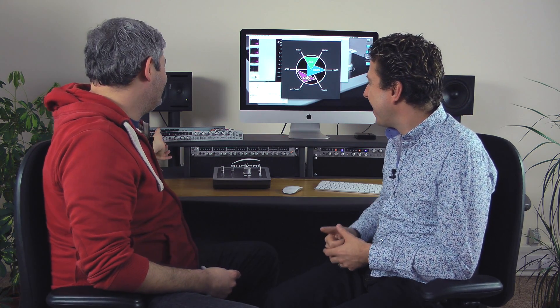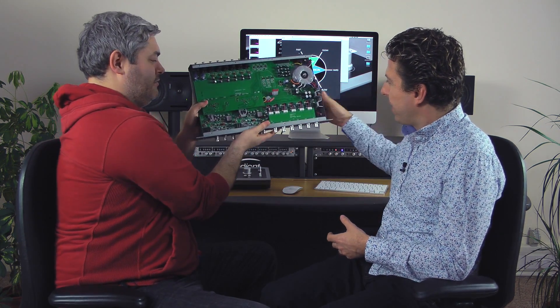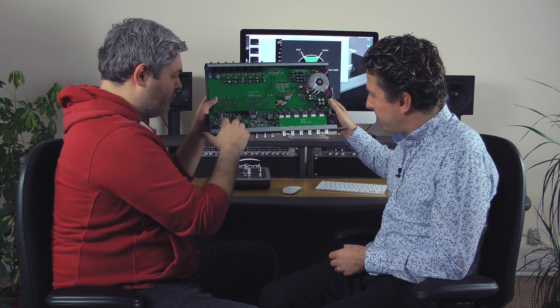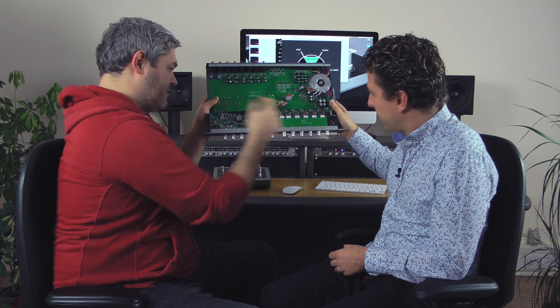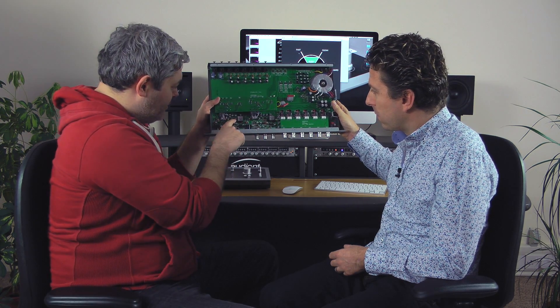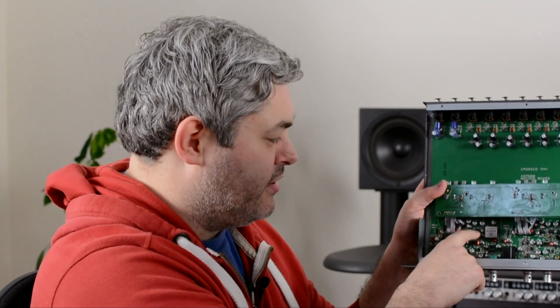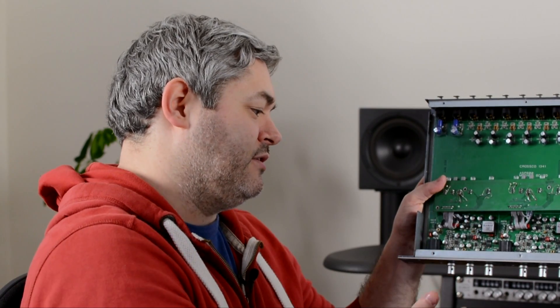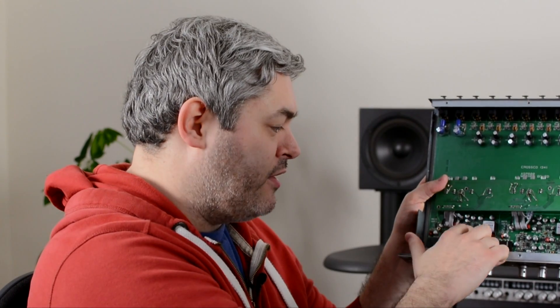So we've got an 800 here and it's currently in bits — prototype. The Audient mic pre is situated down in this left-hand corner; there's a pair, one here and one here, and then a row of six standards there. All of this section is actually the HMX and Iron circuits. These surface-mount FETs are the Class A amplifiers, and the whole thing runs on 32 volts single rail — effectively like a plus or minus 16, but with eight volts more in terms of its ability to swing signal level. It's all very heavily biased into Class A.